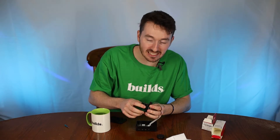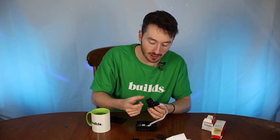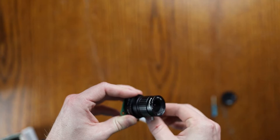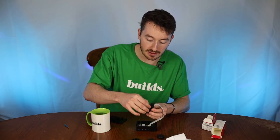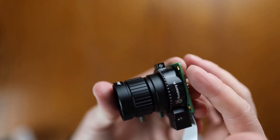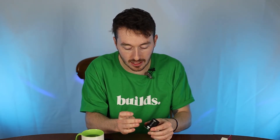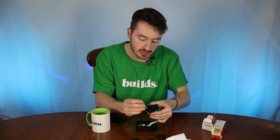The second setting you can adjust is how far the lens is from the back of the camera — this is going to set your focus. If you get a really blurry image, this is where you want to do the fine adjustment. Just loosen up that screw in the near and far section and then move the lens up and down to get it as far or close to the back of the camera as you'd like, then lock that into place. The last section, which requires the little mini tool, is the top screw. If you loosen that up, the actual back of the lens can distance itself even further from the back of the camera. So if you need even further adjustment, loosen it up, do a little jimmying, get the right distance, then go back in with the screw and tighten it right up.